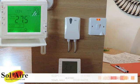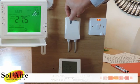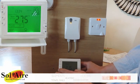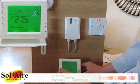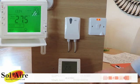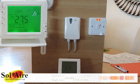With power to the receiver but no lights visible and system off showing on the screen, you are now ready. At the receiver, the small button at the top — push and hold that in for 5 seconds. The yellow light illuminates. With the screen, push and hold the R button until the backlight comes on. You will see the yellow light flashes and 01 is shown on the screen. That indicates that the screen is now paired and mated with the receiver.